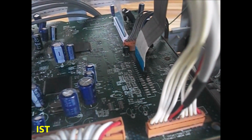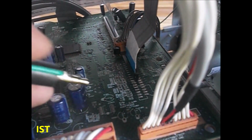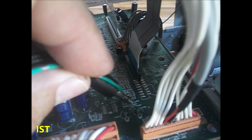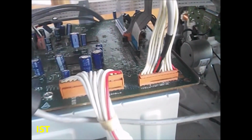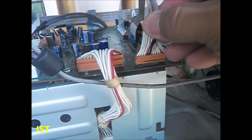Okay, so I will show you if the signal is there. And for the other channel, the resistor is on the other side of the board. So we will just check it here. Okay, so there you go, the signal is there. Now we will move to the next step, where the signal is going through into this wire,